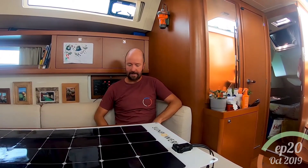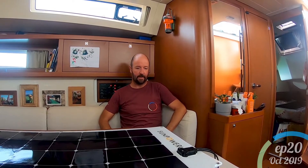The difference between parallel and series is that when you connect your solar panels in series you increase the voltage but keep the current the same. When you connect them in parallel you keep the voltage the same but increase the current. Since we have a 12-volt system we don't want to keep increasing the voltage — each panel is about 29 volts and 5.7 amps. In parallel we'll end up with about 17 amps from the system, which should cover our energy needs quite sufficiently.